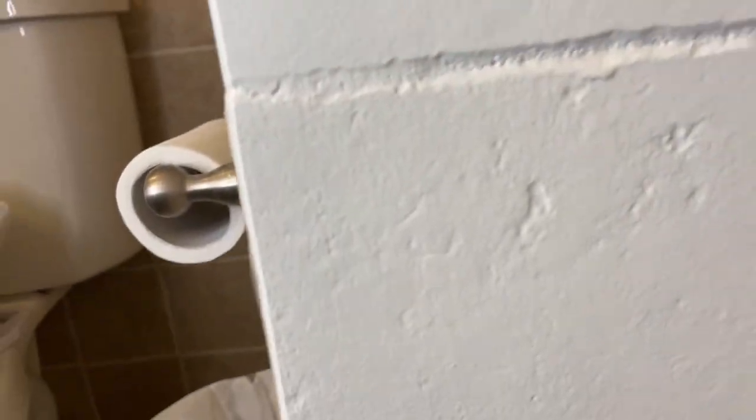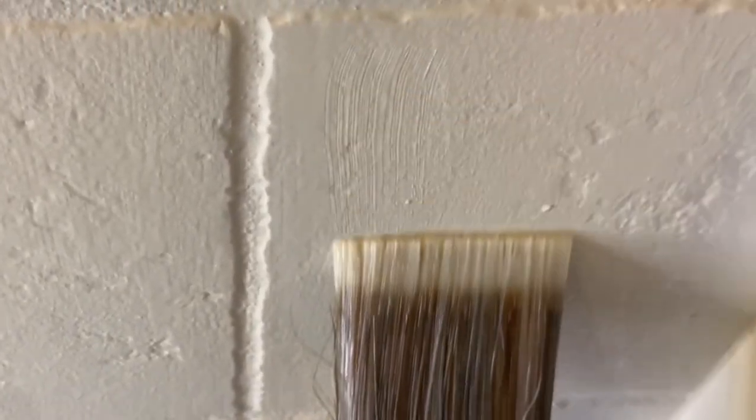When you see drips, just go back and feather them out very lightly without leaving any streaks. If it gets dry it will become tacky, so while it's wet you have to get rid of the drip lines. Since it's very runny, this is normal — that's why it's not designed for vertical surfaces, only horizontal. But it is possible to apply it on walls if you do it this way. I'll put on a second coat later, after I paint the whole bathroom, so the last coat seals everything uniformly.